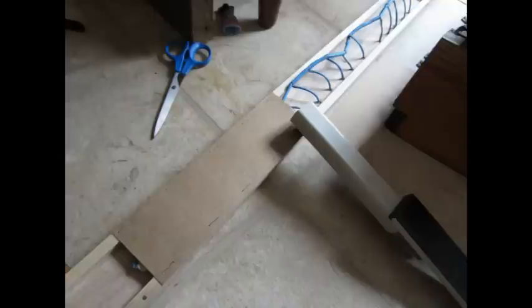Next, I tested the reed switches with the magnets on the pedal board to determine the final positioning for each magnet. I glued the magnets to the metal brackets and taped the reed switches into place on the board. I mounted the MIDI encoder on the end of the board with double stick tape. Now, here's a short video clip demonstrating the pedal board testing.